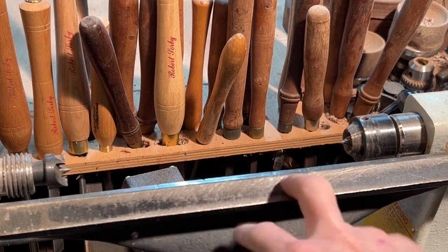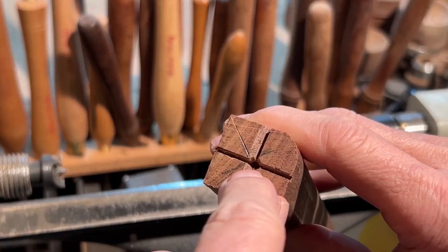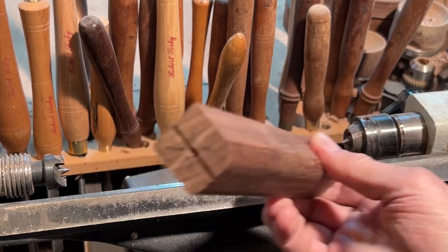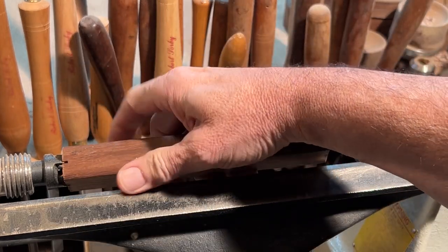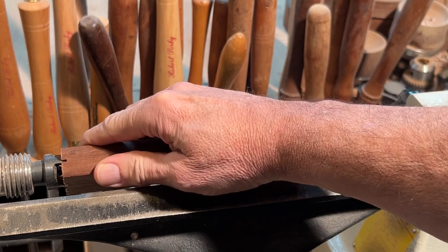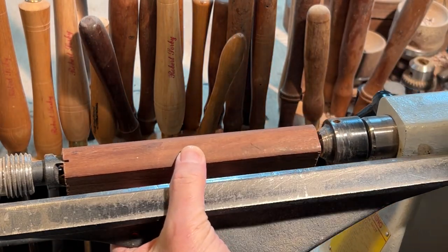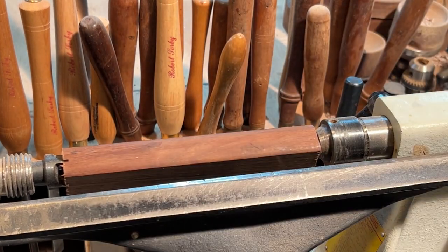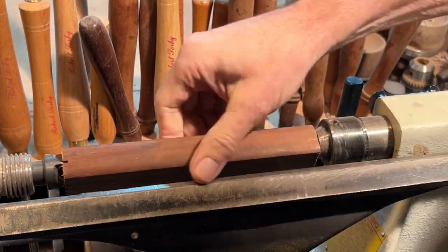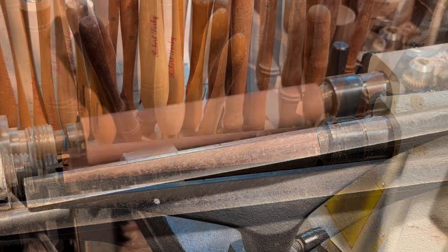We've got the primary setup ready. I've put two cross grooves and a hole punched in the end of the piece here — the two crosses will go to the drive point, and that prevents it from spinning. Then we'll bring the tailstock in to attach and snug it up. We'll run this in a little bit just to tighten it up, then turn down the speed to zero, turn the lathe on, and bring it up.